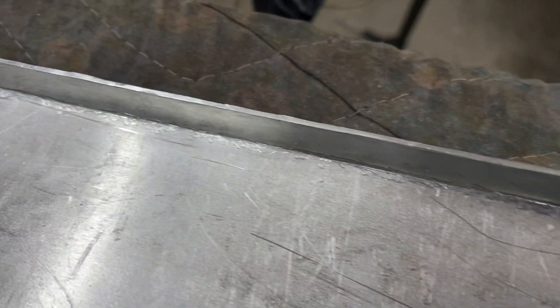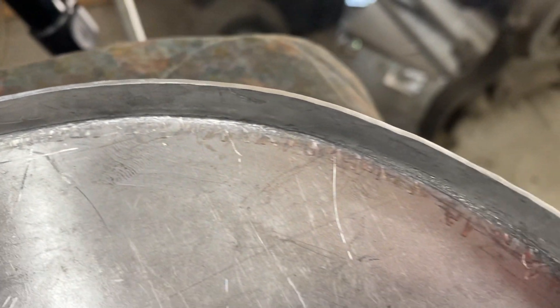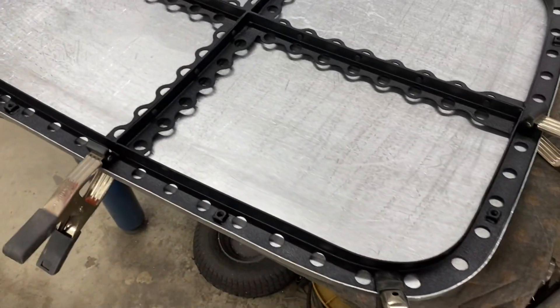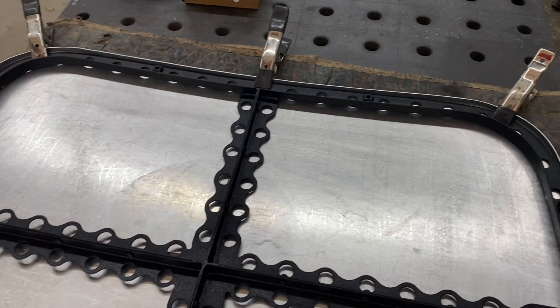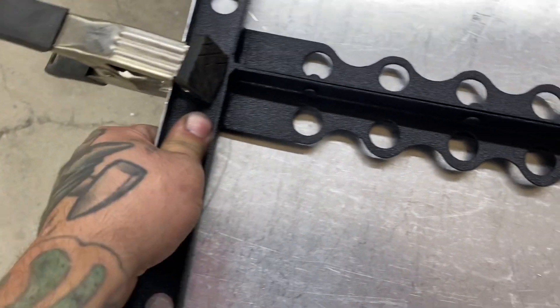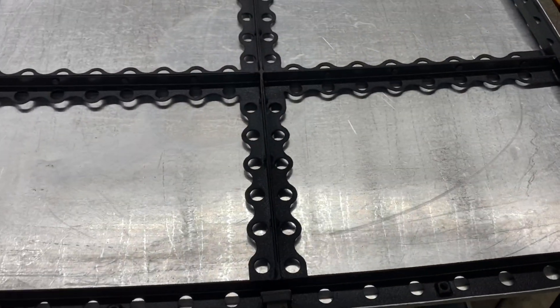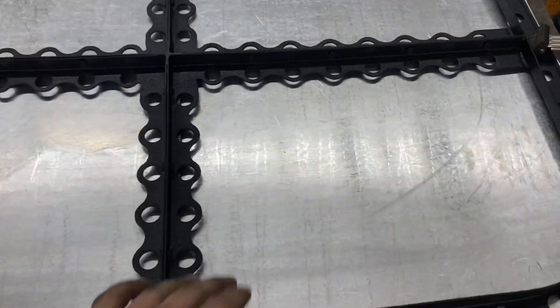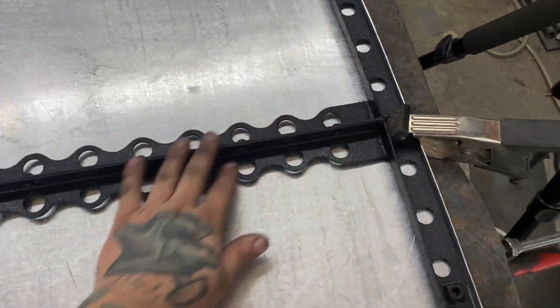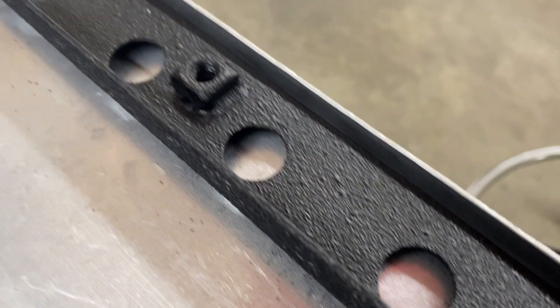You can see that it's folded right on that slightly thin line we did on the Lennox, all the way through the corners. Now I've got the inner structure I made clamped into place here with these little spring clamps. It's not holding it down super tight but it's holding it into position. There's also a piece of foam underneath each one of the ribs — that way it keeps vibration down and helps isolate the aluminum from the steel inner structure. Next up we're going to start to close the hem edge.